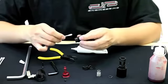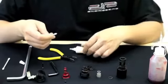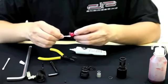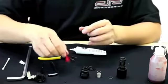Apply a little bit of lube to the top portion of the regulator and check to make sure this O-ring is not damaged. Once that's done, apply a little bit of DP-40 lubrication to the piston of the regulator — apply lube to both O-rings. Make sure not to overly lube these two pieces; only a little bit of lubrication is required.